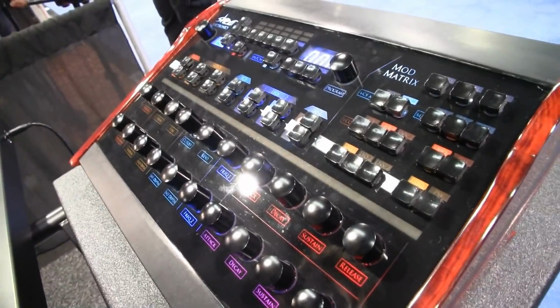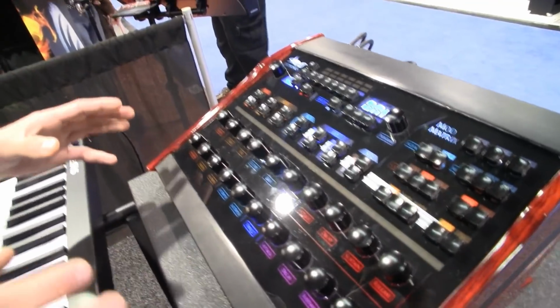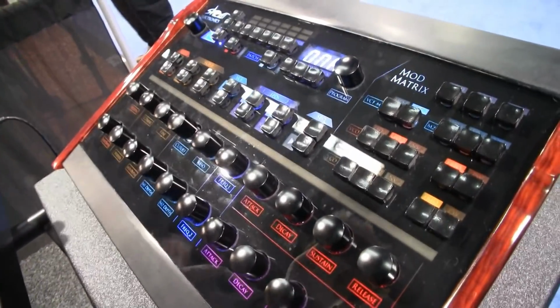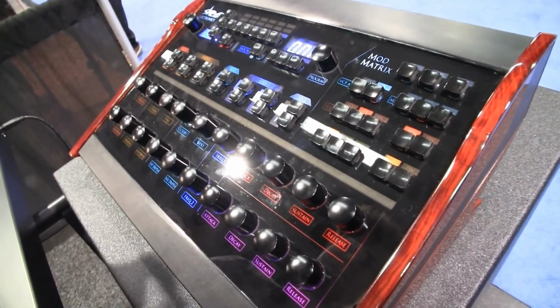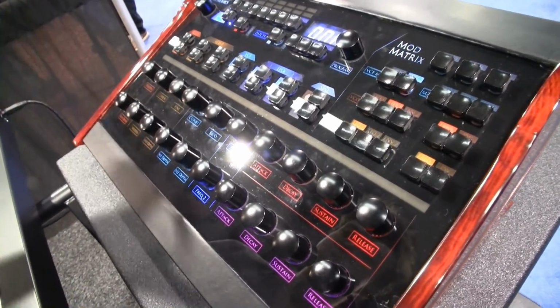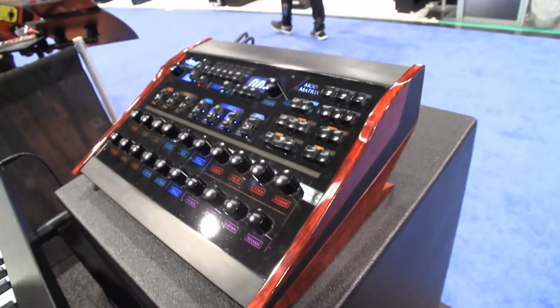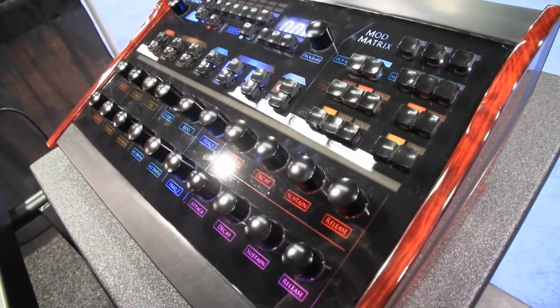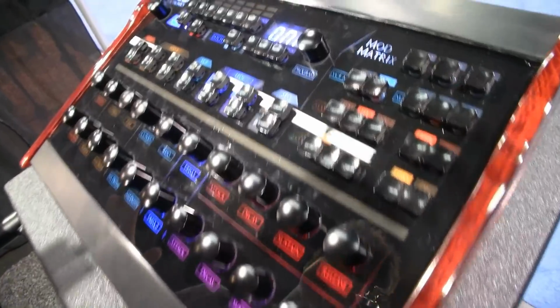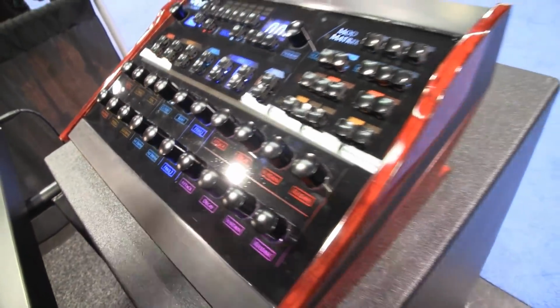So take me through the specifications, how many voices, what's going on here? Basically we've got 6 voices, and it's exactly the same circuitry as the 70s Oberheim polyphonic synthesizers. The only difference is, today we have surface mount components, so machines can assemble them. So it's hopefully going to be a lot less expensive than in the 70s with all the hand-assembled through-hole boards. But the sound, the materials of every capacitor, and the manufacturer of every transistor is the same as Oberheim used on the OBX in 1979.